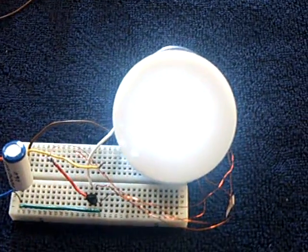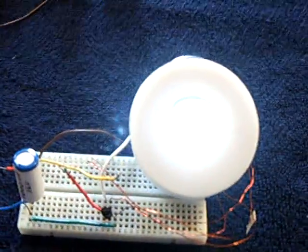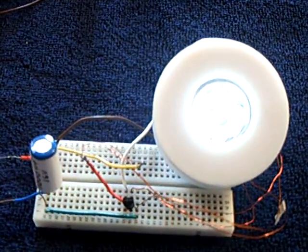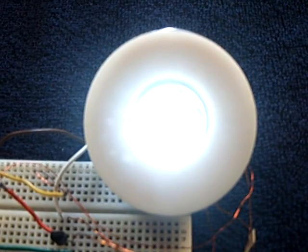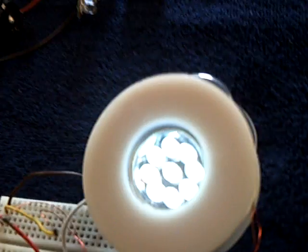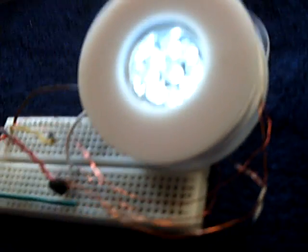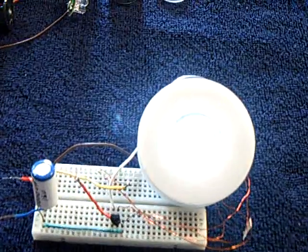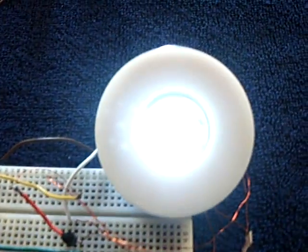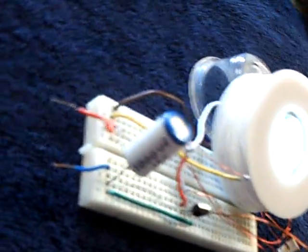Now, if that had been a 1,000UF 16-volt cap at the 40 milliamp draw, that would have dimmed down almost immediately and gone out. This will run for about half an hour on that little super cap. It dims down, and of course the voltage drops off. But you do probably get the square wave out of those LEDs like you show.